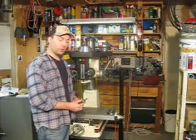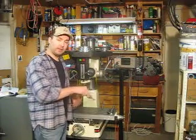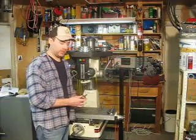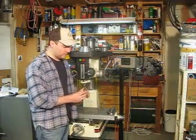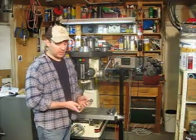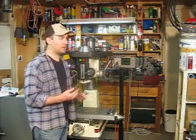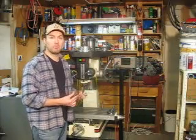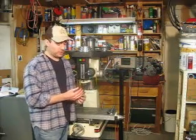This is a standard woodworking routing bit, and I'm going to be using it on MDF to cut templates out for routing hinge pockets. What this is is a half-inch collet. I'm using a half-inch collet as opposed to, say, a one-eighth inch collet because it fits a half-inch routing bit. If you wanted to use a smaller woodworking routing bit to cut plastic or some sort of composite or wood or MDF like I'm doing, you would use a quarter-inch collet.